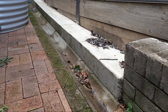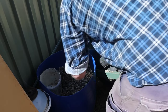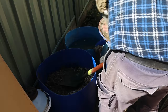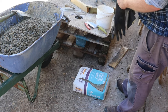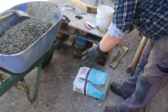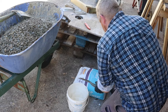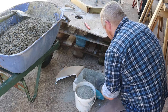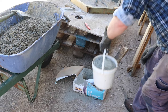I had some concrete materials left over from building this retaining wall two years ago. I'll use a bucket to measure this sand and gravel into the wheelbarrow. I like to wear rubber gloves when I'm working with cement — that way your hands only get sweaty but not dry and cracked. This bag of cement has been in my garage for two years so it's starting to go hard and lumpy. I'm measuring it in the bucket and breaking up the lumps as I go along.